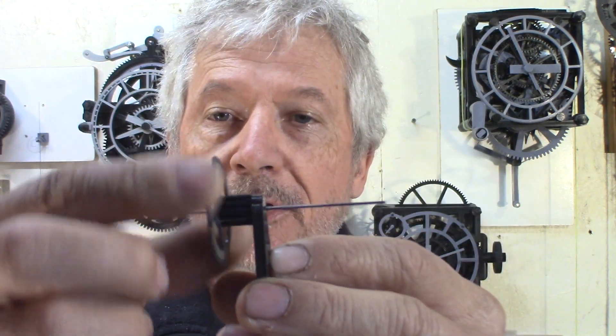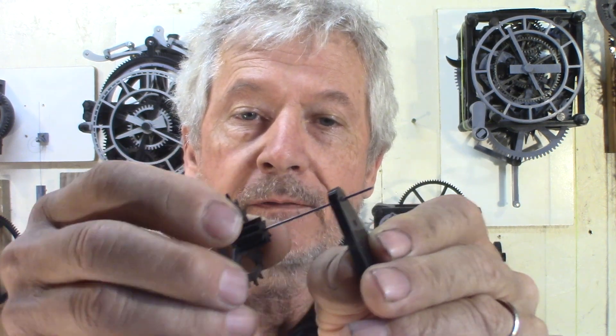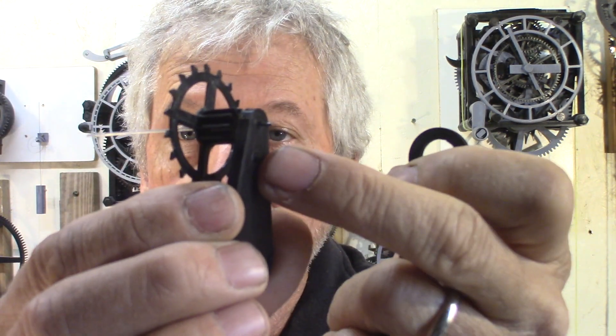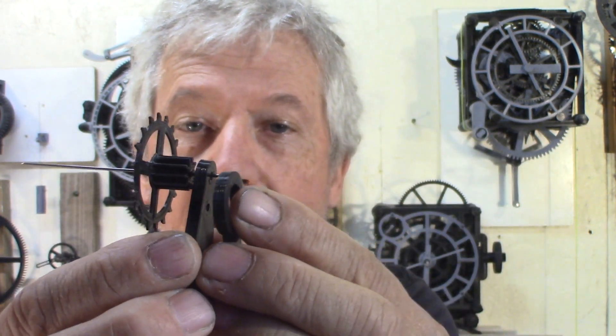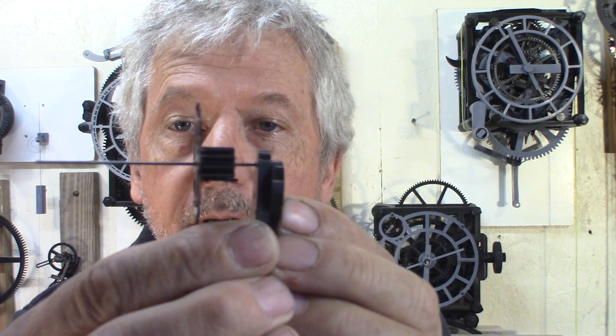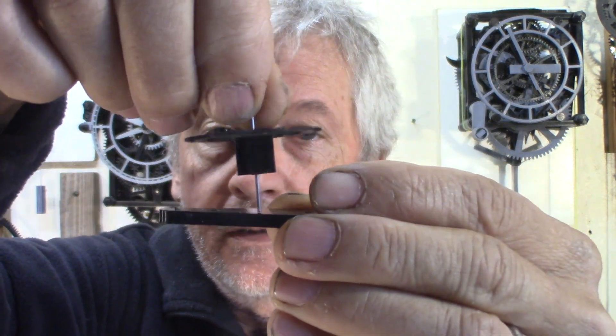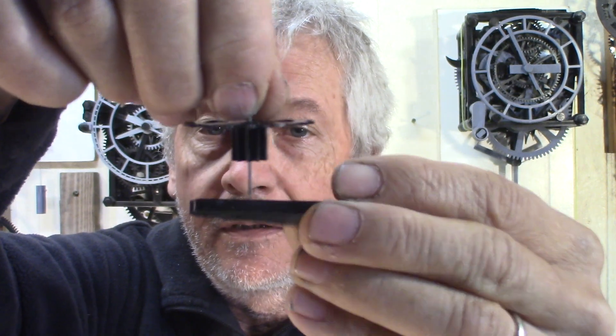The last thing: if I had a gear like this against the plate, that would be too much friction. So my idea is to have the gear come on the tight side, and then instead of having the gear face against the plate, I'm going to add a little plate fixed with a screw that will push against the end of the arbor. So the only friction at the end of the arbor is the arbor tip against the plate — a much smaller contact area than having the full gear face. Lots of little things to improve.